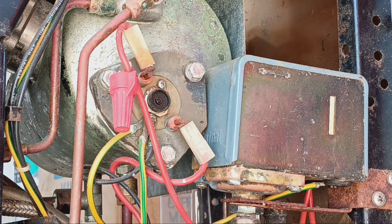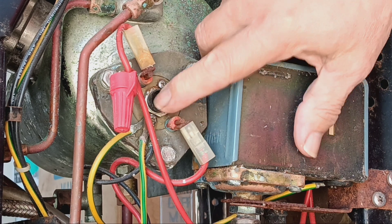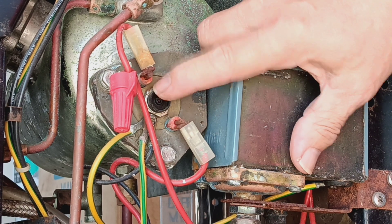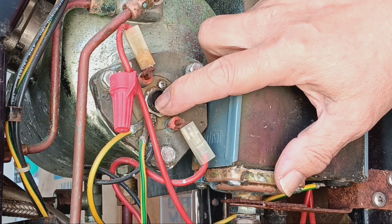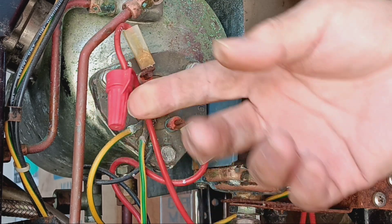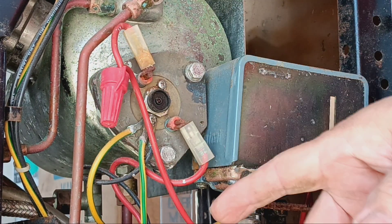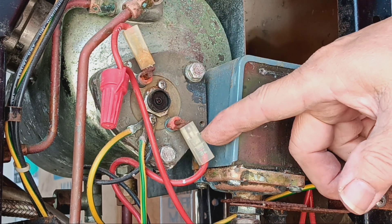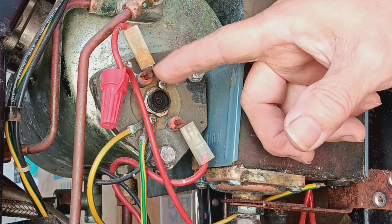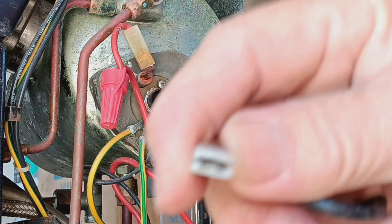Several of you requested the actual removal of the heater element. As you can see, the cap is even gone — this is the burnt out safety high limit. This has been modified to bypass it. You can see this is a clean lug and this is a dirty lug — it's starting to rust.